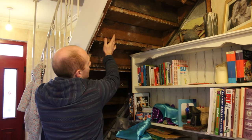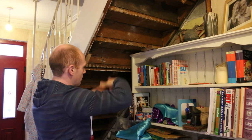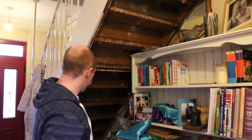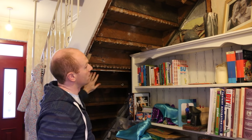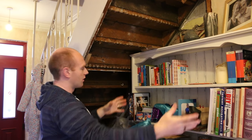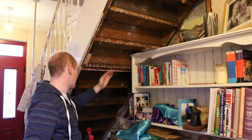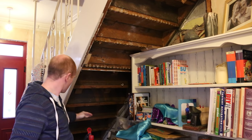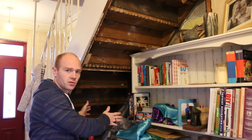I started pulling off all the paneling they'd put all the way down here, and in addition to that there was some hardboard that was wallpapered. I stripped it back to see what we had. What I'm going to do is batten off here with some two-by-ones and then board the whole area. That gives us a little bit more space, means we can fit some furniture in here. I'm probably going to drop a stud wall down in the future, but I want to skim all the way down to the bottom of the stairs so we could potentially have some storage under there.